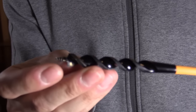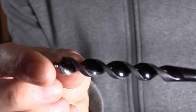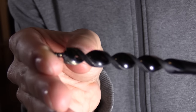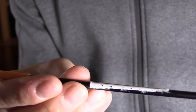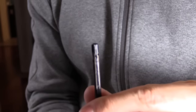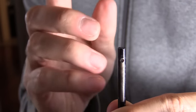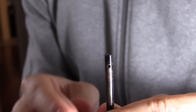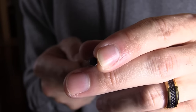At the end of this flex bit, you've got a screw tip. You've got an access hole right here to attach a pull wire. And then on the other side, this is a 36-inch flex bit. But on the other side, you also have an access hole to attach a pull wire so you can run cables up and down from your attic. But this whole thing is smooth and round except for the other end where it attaches to the drill, so you get better grip.